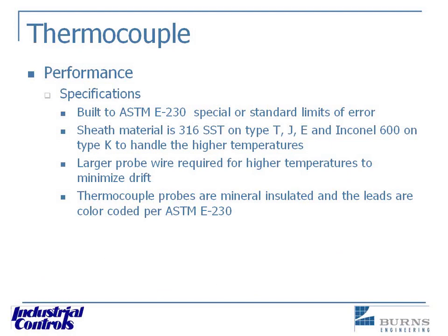Wire size also affects performance — a larger wire size will drift less at higher temperatures. Construction techniques are important to ensure proper protection. A compressed ceramic insulation is really ideal to protect thermocouples, and there are even some used at higher temperatures where an inert gas purge further protects the wires from oxidizing or reducing atmospheres.